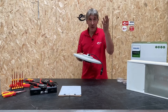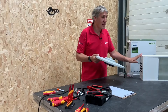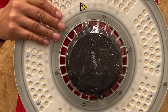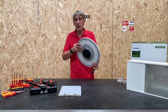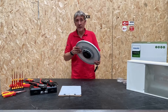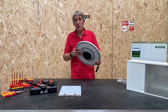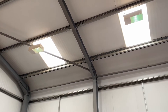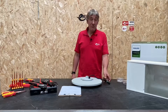What you have to remember is however big that looks, it's tiny compared to the shoe box you're typically replacing. The version I've got here is 10,000 lumens and that comes in at 69 watts — nearly 150 lumens per watt. That's the prime motivator; most people are moving to LEDs for that energy saving. But this range goes all the way up to 25,000 lumens, so you can typically replace everything from those 250 watt to 400 watt metal halide lamp sources still out there in their droves.